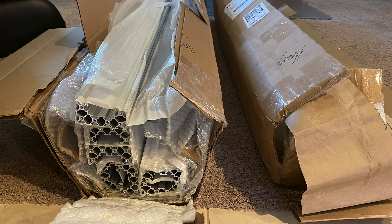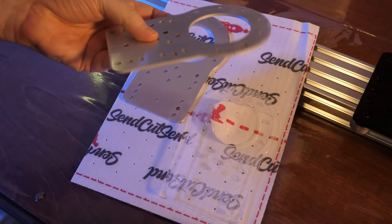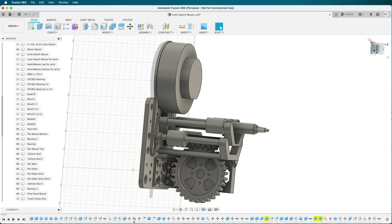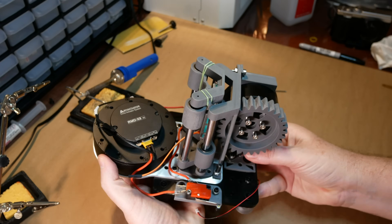The rails and plates were purchased, but I made several custom parts. I designed an adapter plate so the motor could be mounted to the gantry plate. The rest of the parts were designed in Fusion 360 and 3D printed. I printed an adapter to attach the gear pulley to the motor and the entire printhead mechanism.